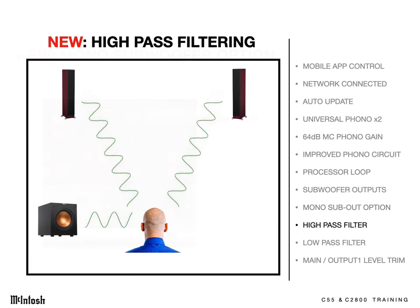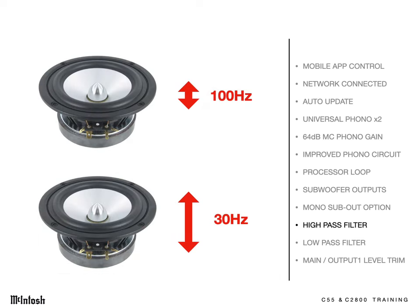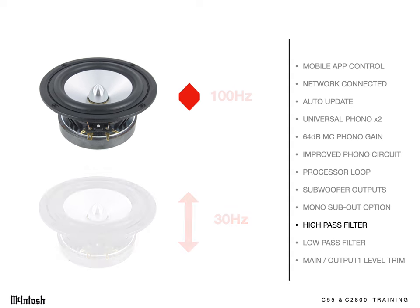When a subwoofer is simply connected to a system with full-size speakers, bass will come out of three locations at once, creating hot spots and dead spots for bass in the room, since the waves can cancel at certain distances and angles. We can now take care of that. Also, deep bass notes mean very large cone movements in your main speakers, which can lead to distortion at high volumes, or speaker damage if the volume is set too high. We can take care of that too.